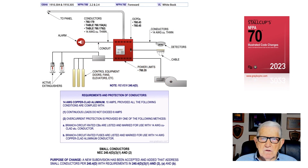This illustration deals with small conductors in accordance with 240.4D3, 1, and 2. The boxed information gives the rules. You can see an alarm system listed with section numbers directing you to the right sections for more information, along with the types of devices it can supply. The requirements are shown in the boxed blue text, covering protection of conductors. It discusses a number 14 copper clad aluminum, 10-amp type conductor that can be used provided all the following conditions are complied with.